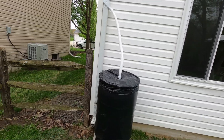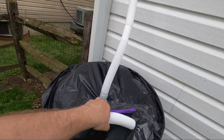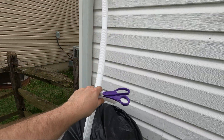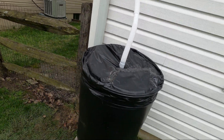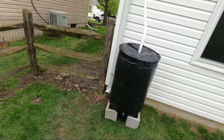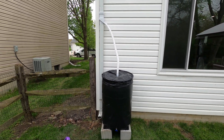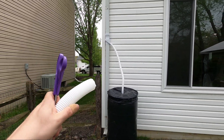If I were to do this again, the one thing I would change is installing my inlet port towards the back of the barrel so the hose would come down along the house a little bit cleaner. But aside from that this thing's going to work. That is how you install a rain diverter system using a downspout rain diverter and a 55 gallon barrel. If you found this helpful let me know by hitting that like button, leave a comment if you want to see more videos like this, and don't forget to subscribe. Thanks for watching.